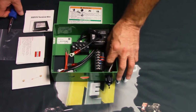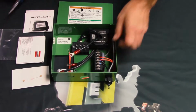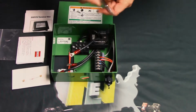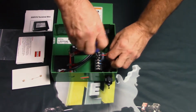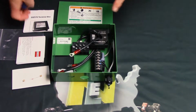You have to change some of the wiring here on this unit in order for it to operate with a bimetallic thermostat. For this, I'm going to turn this back over to a Phillips bit, and I'm going to simply remove these 2 orange wires right now off of the 2 terminals that they're on.